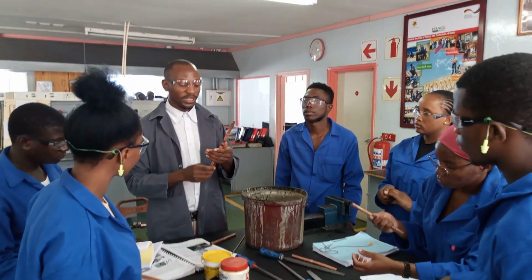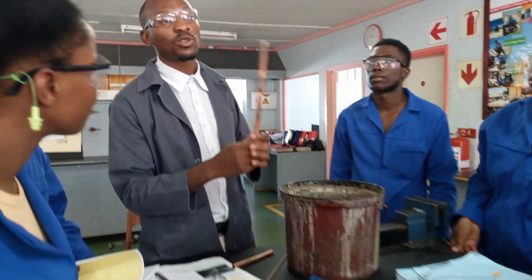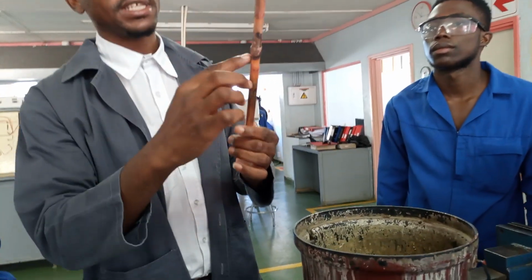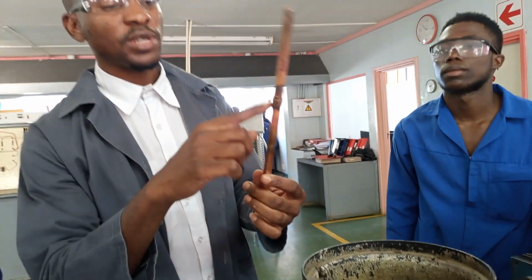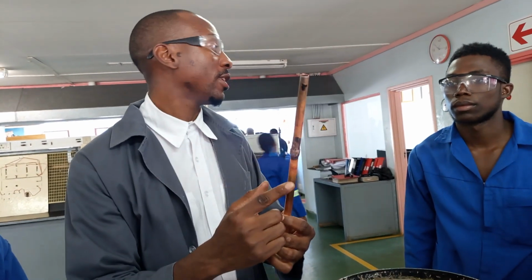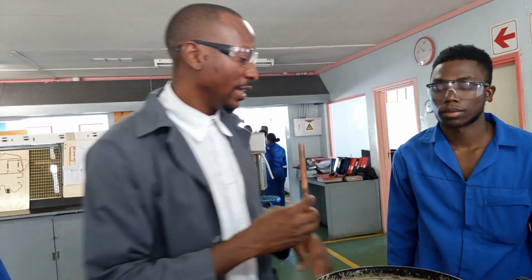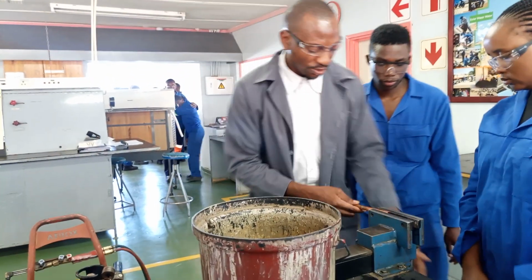Now I'm going to give you feedback as to whether you have done it the right way or the wrong way. Remember that if your flame is too much, I will be able to see from the discoloration. But this was not because of the flame being too much. The flame was okay, but you took too long. Now the pipe is overheated. It's also not sealed off clearly. So let me guide you on how to do it.